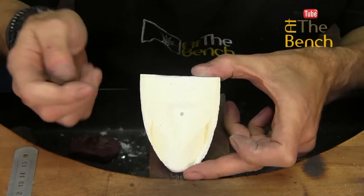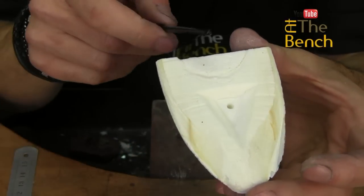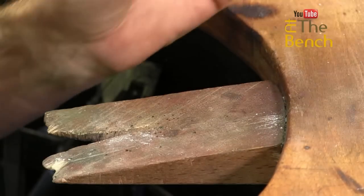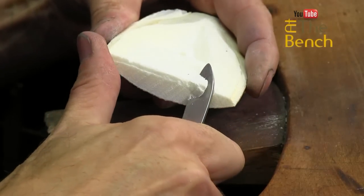I'm going to get the end of my needle file and just put a hole right in the middle — that will appear as a raised section. Get your paintbrush in there, paint it all around, and just refine it. Now we've got our simple triangular cavity. Here is the pouring channel — let's get our penknife and carve that out.